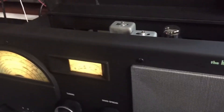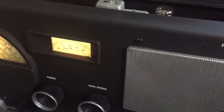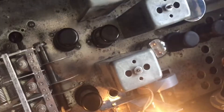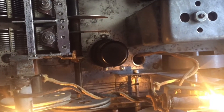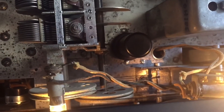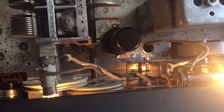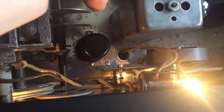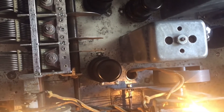There's no question this has been a success. I've been with this station for a while now and I haven't even had to touch the band spread tuning. Just touching this vacuum tube — there we go. It's warm, it's not hot. I think I have a bad socket in here, but I found that pulling it up a little bit seems to make better contact than pushing it down into the socket.